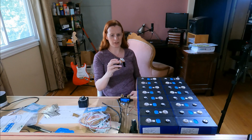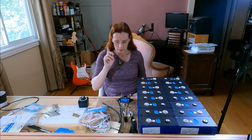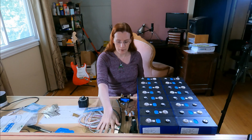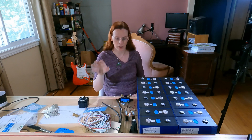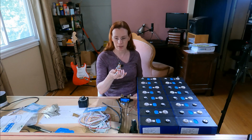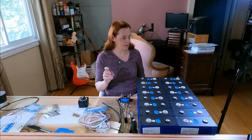So I believe these are high discharge, high current, something, something, something. They get sand to break the arc. So that is going to be our primary safety device. The BMS has its own internal overcurrent protection that'll cut off, but this here is for when something very, very bad has happened. If you blow this thing, it just saved your life probably, or at the very least saved your eyes.